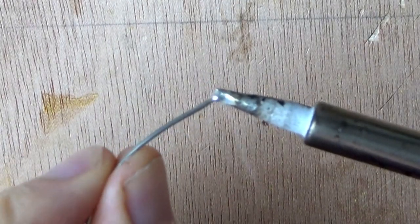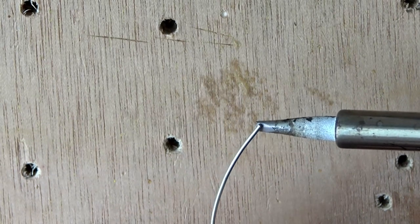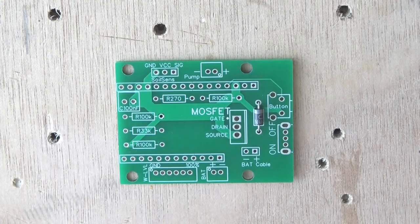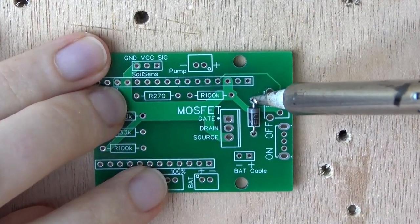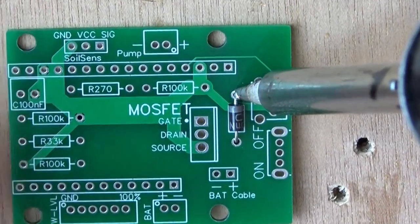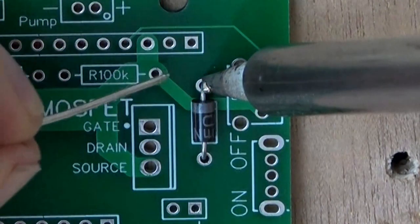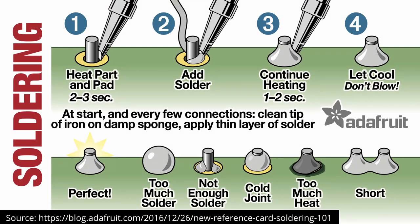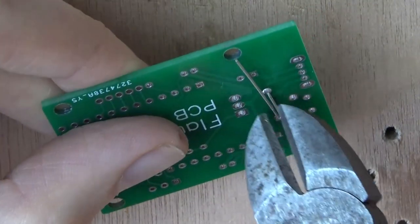Take your preheated soldering iron and apply a small amount of solder to the tip. If it doesn't melt it's either because the temperature is too low or because there is some dirt or rust on the soldering tip. Remember to clean your soldering iron with a wet sponge every now and then. Place the tip so that it touches both the copper pad on the PCB and the leg of the diode to heat them simultaneously. The small solder blob on the tip is supposed to speed up the heating process by enlarging the contact area. After two to three seconds the metal should be hot enough — add a little more solder to the melting zone close to the tip, then remove the soldering iron after one second. This picture shows what a proper solder joint looks like. Repeat the same process with the other side of the diode and then cut off the excess legs on the back side.